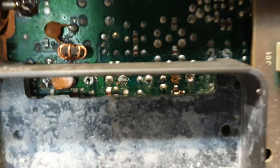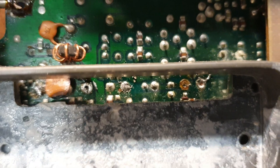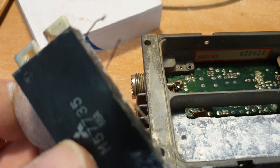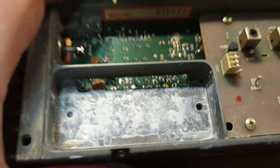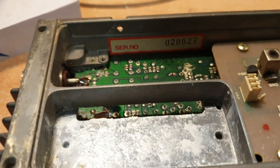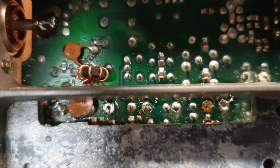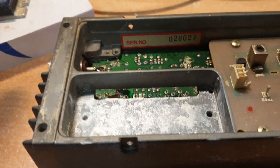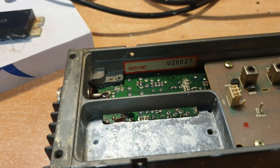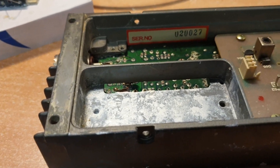Now this is not too difficult once you've got them out. They're plated through holes so they are a little bit difficult to get out generally, but we'll go and clean up those five holes so they're very nice. Once you've got a new component — because these legs are so long — a lot of people actually leave them in a little bit long just in case they've got to pull them, because they're a pain to put back in when they're short. You do need a bit of length to be able to bend around, because of course this sits on a right angle and it's got to come around and down — there's quite a reasonable amount of drop there. So once again we're after an M57735 — if anybody finds one on their radio desk somewhere, send it to us, we'll buy it. We're going to have to track one of those down.